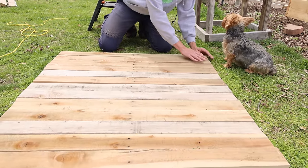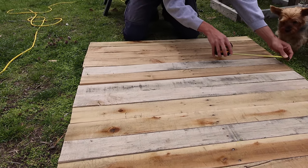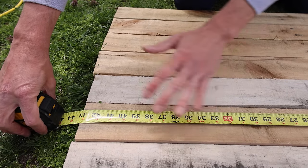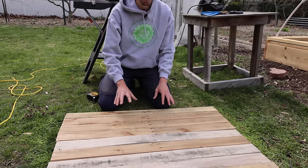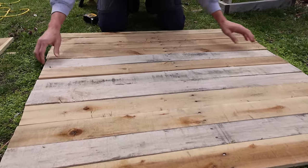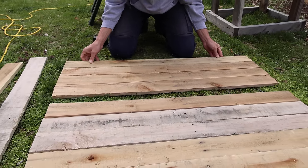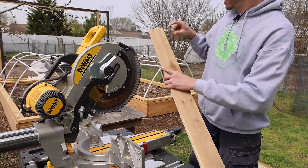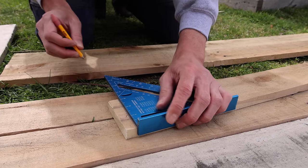Now I can go through and find my shortest board. This is my shortest board right here, so I'm going to measure everything off that. When I get the measurement it's 43 and about a 16th of an inch, so I'm going to cut every board to 43 inches. I also noticed I have a few of my worst boards — like one that's cracked — so I'm going to save those on the side and use them as braces. The rest of the boards are pretty good to go. I measured from the squared edge, made my line with the square, and now we're going to cut them all on the drop saw.